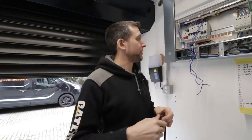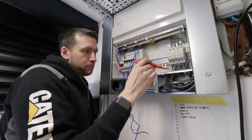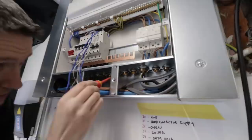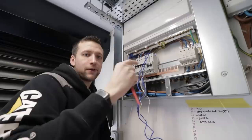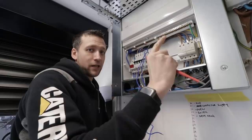There were one or two people saying, with this configuration I've done here, why didn't I cut a piece of Paxilin between the board and the trunking rather than do the knockouts like this — where I've just done it underneath like you can see there. They were saying, rather than do the knockouts, why didn't you just cut the whole thing out, like you see on three-phase boards, and cut a nice piece of Paxilin in?